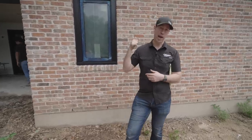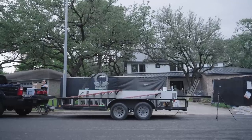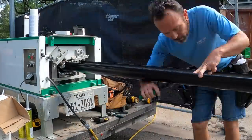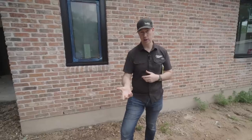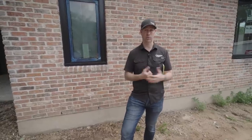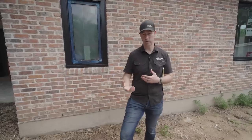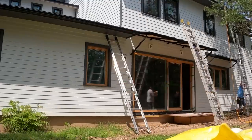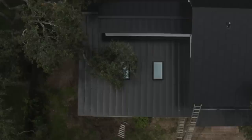And then when you do these half round gutters, the materials are not really any more expensive. It's really the same steel, but fewer people have the machine that's gonna make a seamless gutter. So your installer might actually have to get them in 20 foot runs from his supply house, let's say, and have a seam there if he doesn't have the machine. Or he could actually order it from Berger up to like 30 some feet where they could ship them out in long lengths to the job site. But what really costs a little bit more in half rounds is the labor. You know, Lionel told me if this was a K style gutter, he'd probably finish this house of mine, which is 2,800 square feet. I've got like 220 some linear feet of gutters.